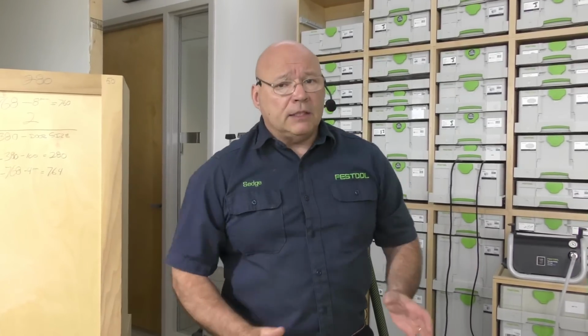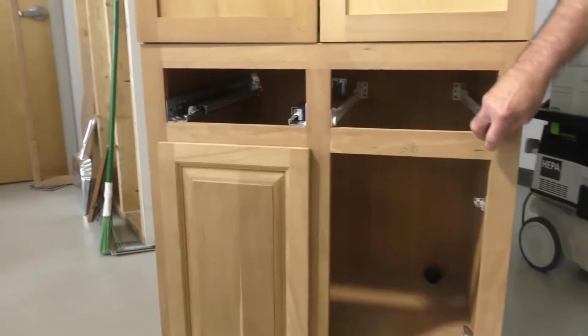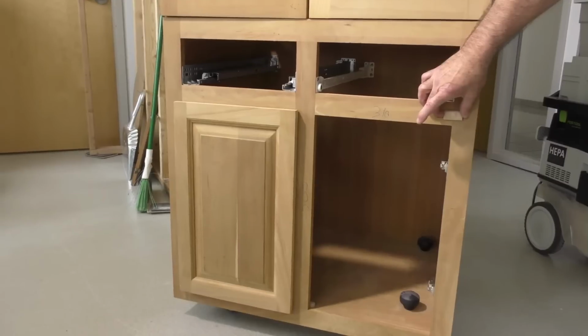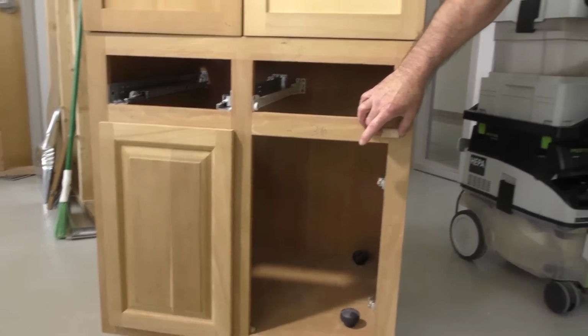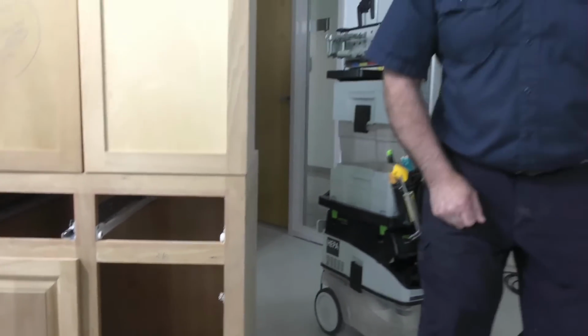So follow me on this little journey I'm going to take you on, laying out a face frame, because this is the face frame we're going to build. We're going to use 6x40 Dominoes, 6 being the thickness, 40 being the length. Let's do a little metric to kick it off. Big D, what's half of 40? 20. My God, he's good at metric.